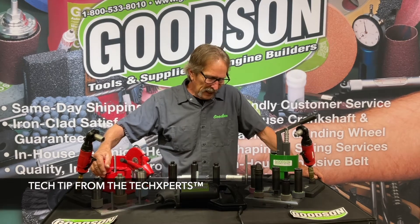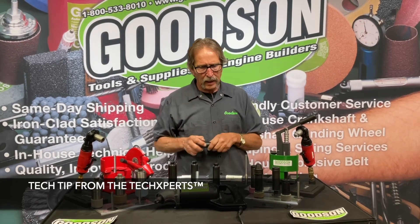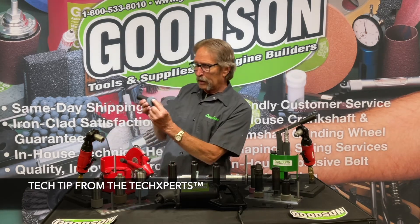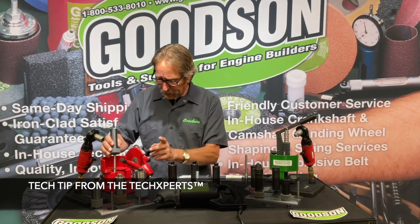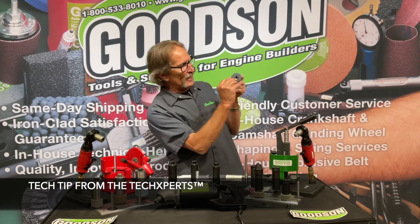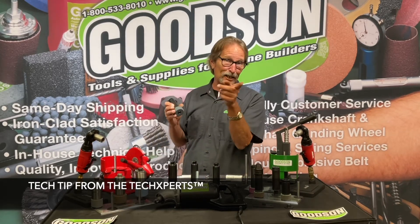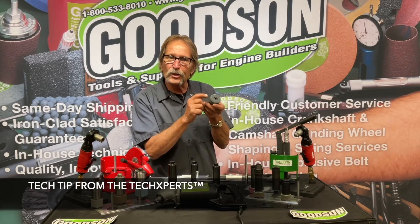Let me give you a little tech tip. If you have a general purpose stone, you've been grinding, everything's good — it's the correct angle, you're happy with everything — and now you want to put a finishing kiss on it. That's where we can adjust the speed of our dresser. At normal speed, I'm actually unloading this abrasive, exposing sharp new grains to get in there and grind that seat. However, if I speed up and go really fast across it, I can take this general purpose stone and make it absolutely more aggressive — I'm really opening up the pores. And the opposite: if I slow-dress across it, similar to that flat spot on the diamond, I'm actually closing off the grains, closing off the pores, closing off that bond. I can then make this stone act like a finishing stone.